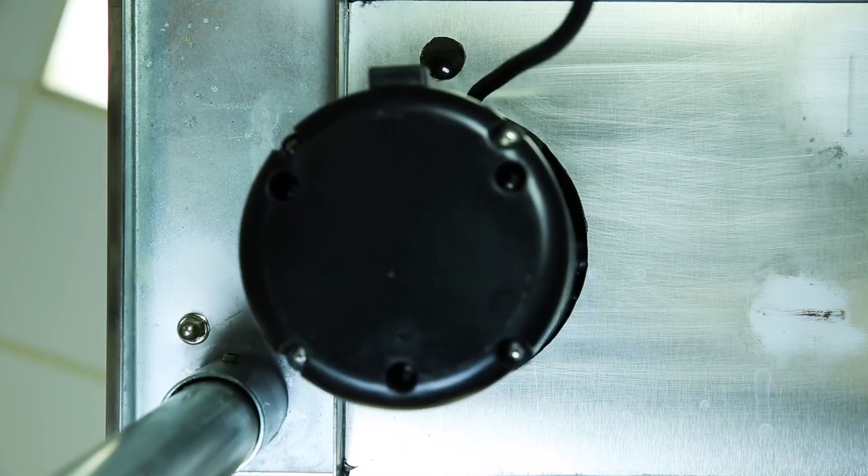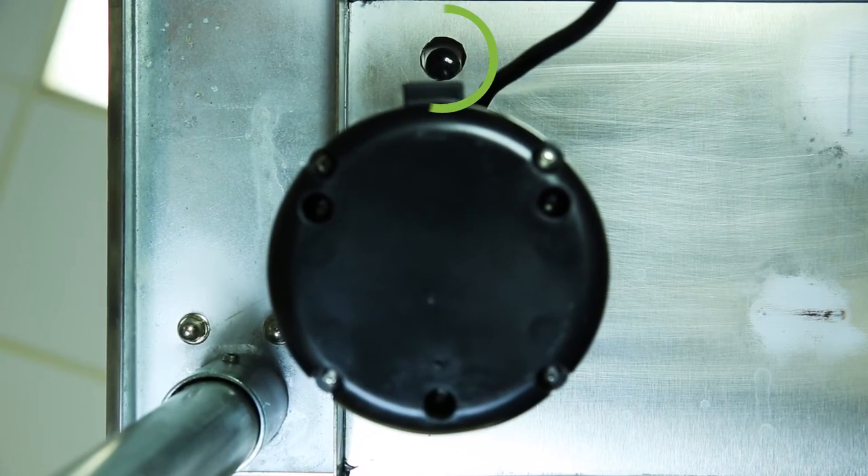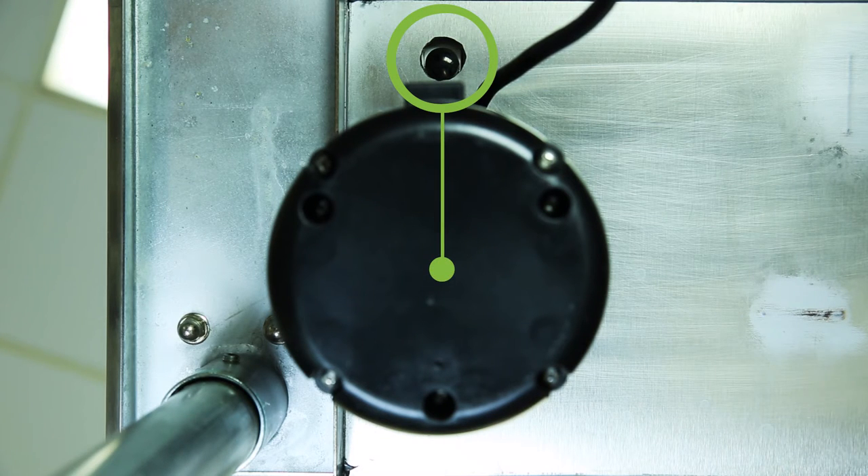To secure the foot, drill a three-quarter inch hole the correct distance indicated from the installation manual from the center of the countertop hole. Replace the outer screw from the cord cover with the anti-rotational foot.